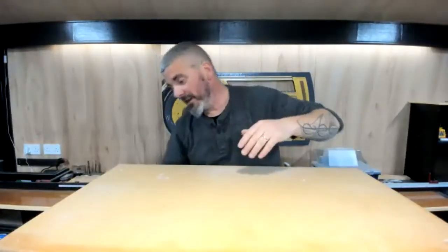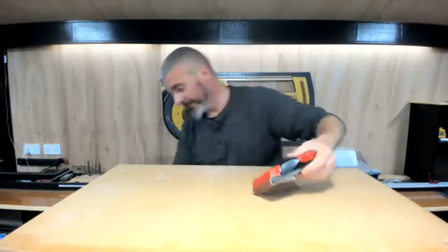Because paint, if you don't do that, if you think of over the years, the amount of nicotine stains you get on walls and things like that, and the amount of stuff coming off us and our environment, you can get a kind of almost semi-oily surface on the wall. And that's when paint delaminates and it cracks and it peels and it does all that stuff. And that's all due to not having it prepped properly. So the age-old thing is get sandpaper.